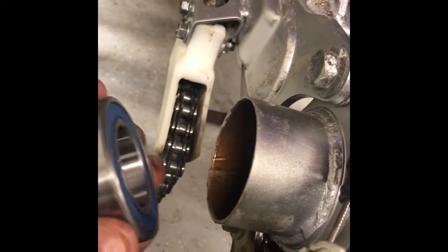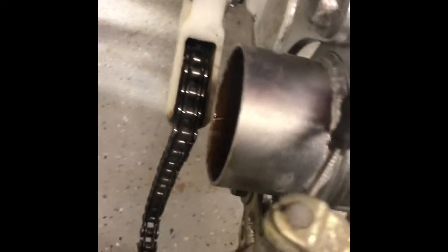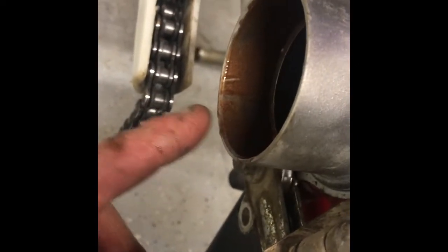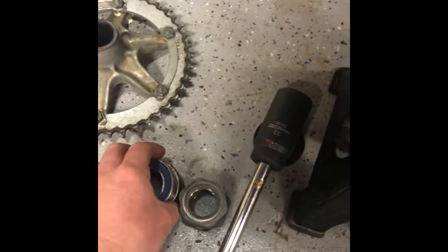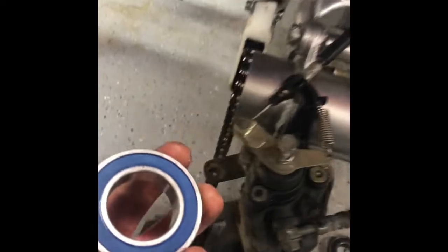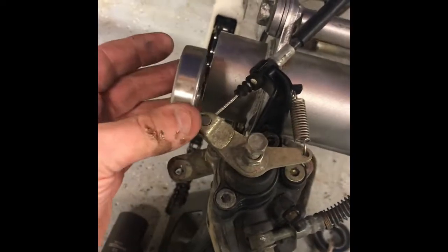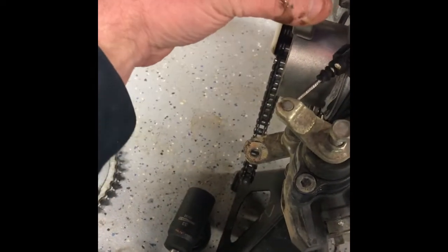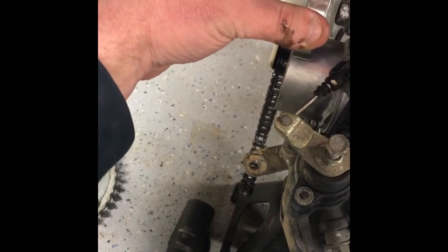Another note about using the old bearing as a guide: apply anti-seize, get it cleaned up nice on the carrier, cool the bearing down, heat the housing up. This housing looks about half an inch wide but it's almost an inch deep, so you could almost fit both bearings in there. Be very careful — if you tap that old bearing in too far with the new one, you won't be able to get the old one out without driving it back out, which risks ruining the new one. The old bearing is basically just a guide to get the new one in just far enough that you can still get the old one back out.